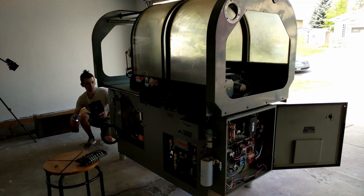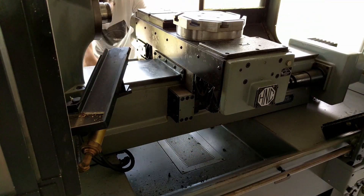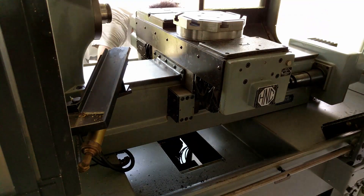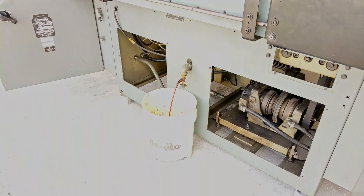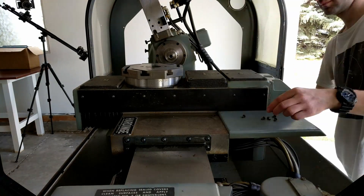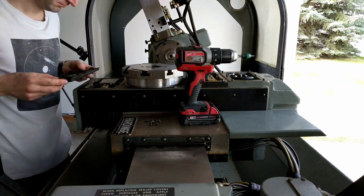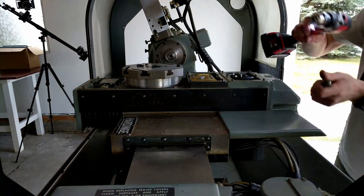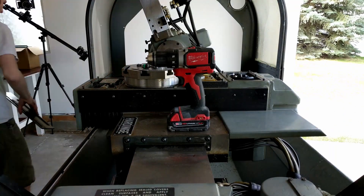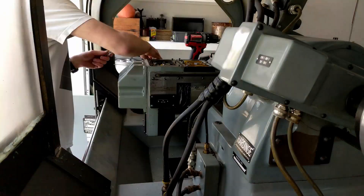Taking all the panels off, the next step I wanted to check was the oil sump. So I took the chip pan or chip guard out, found a bunch of oil in there, dropped a screw to make sure I know how deep the oil is, and then drained the sump so I could find my screw and keep from dropping more stuff in there. I took all the cover plates off the carriage, which gains me access to the encoder feedback for the turret as well as all the pneumatics for it — something I'm going to have to interface with down the line. I also took all the covers off the servos and electronic covers because I'm replacing all that, so I need access.